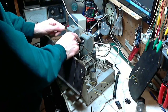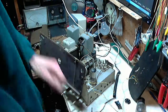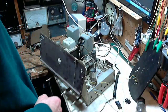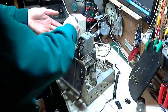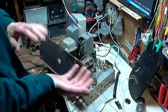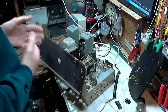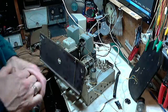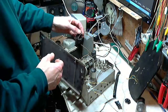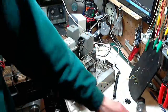You know what? I can cut this wire now, here at the top, and bring this right out. Fit the new wire on it out here with a lot of length. Feed the new wire through the socket back down in the hole. Don't even have to set the pin. Flip the radio over, find out where the wire I'm working on goes, and then reconnect the new wire, cut it to length, and reconnect it. I think that's basically the approach I want to take here. Sounds great. So let me get my helping hand here.